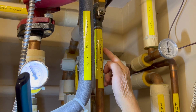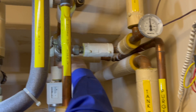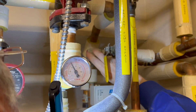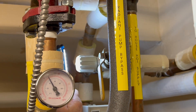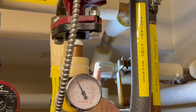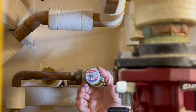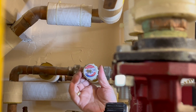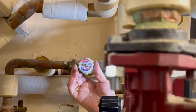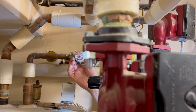This mixing valve adjusts the heat going up to the rest of the house. You've got cold water coming down this pipe to the mixing valve and hot water coming out of the water tank from behind. The knob has red on one side and blue on the other — turn it toward red and water to the house is hotter, turn it toward blue and it's colder. Right now this mixing valve is jammed from scale, and the boiler's about to turn on — I just heard the relay click.